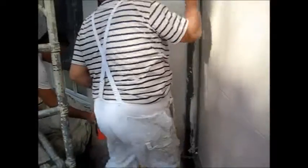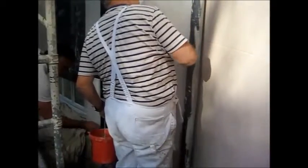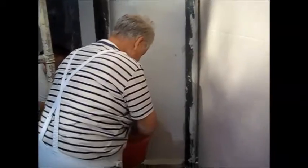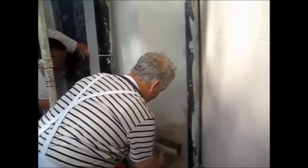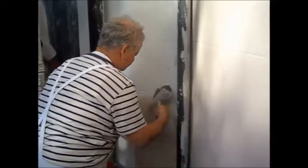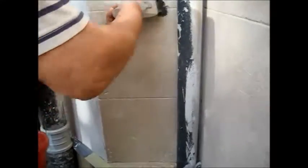One painter, Peter Watkin of Peter Watkin's Painters, Newtown, starting in the lower corner, going to work upwards. Just applying the paint, working it in in all directions. Finishing with a crosshatch light finish. You need to work it into all of the areas because you can't touch it up.